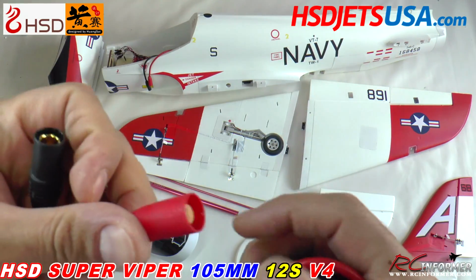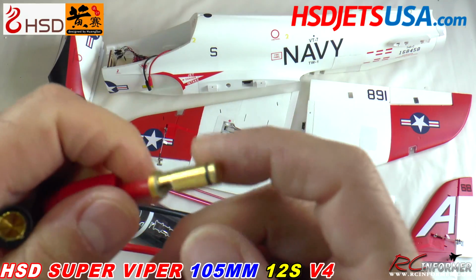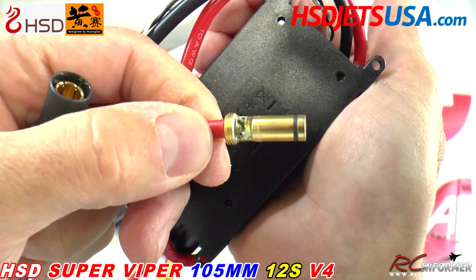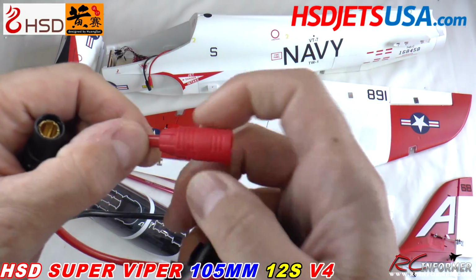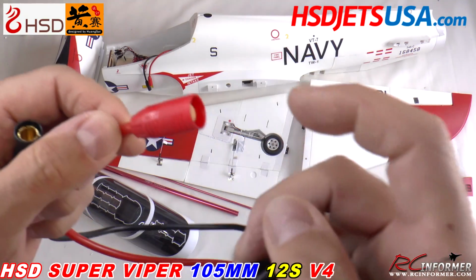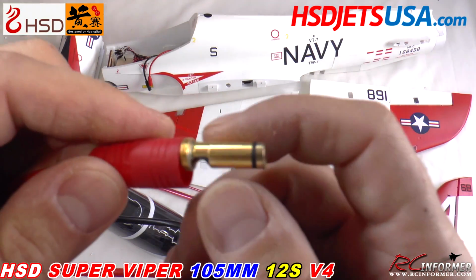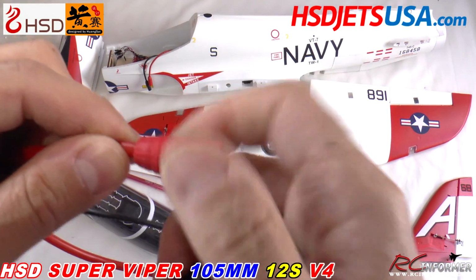Look at this thing. Again, AS-150 spark arrestor bullets, 7 millimeters. These are the best, guys. These are just simply awesome. So again, you make all your connections with your batteries, and then this red one with the spark arrestor tip is the last one, and there's either a capacitor or whatever's in there to absorb the initial contact, and you get no spark, so the spark is eliminated.